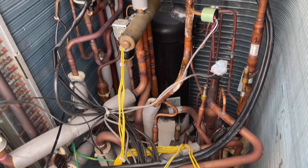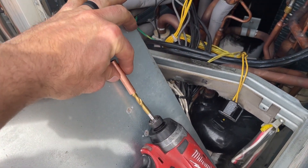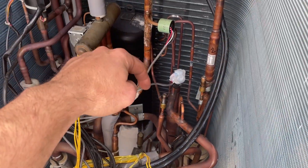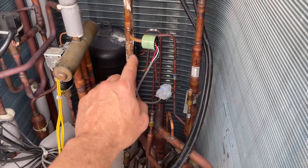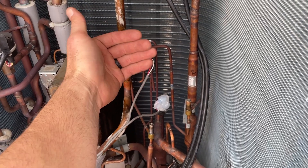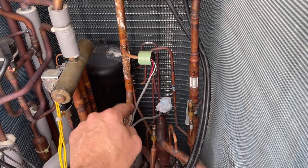What I need to do here is drill this hole kind of fast. I'm not going to use a unibit because I just want to punch right through it the exact size. I've got a three-eighths piece of copper over there to stop me from punching through to the bottom. I have it started here, and yes, I am moving the location — I don't really like sensors flapping out here where the weight can just sort of make them bounce and break free. I'm going to put both of these upright.